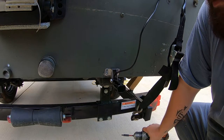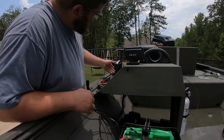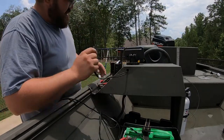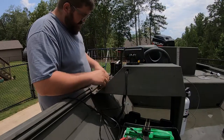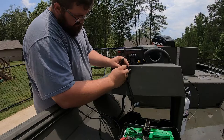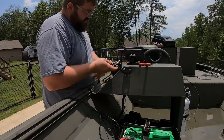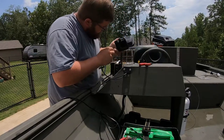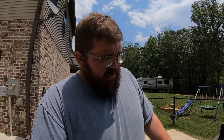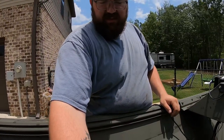I'm not going to tighten that up super tight — just enough to kind of hold that transducer so it's not going to move, but very easily. If you hit it with something, it will move. That's kind of the purpose of the design. It might be a little bit too tight, but that's just — it's my boat, it's the way I like it. I paid for the depth finder, I paid for the boat. I'm not going to run the wire through anything — there's foam in the way — so I'm going to run it up beside the throttle cables, run it through here through this existing hole, and put this cover back on. I'm going to zip tie it, make it look professional, even though a professional didn't do it.